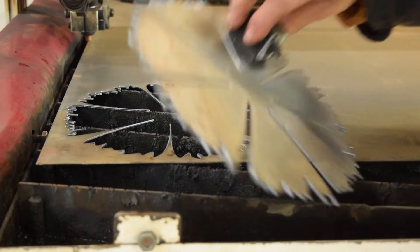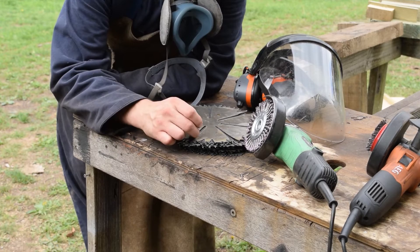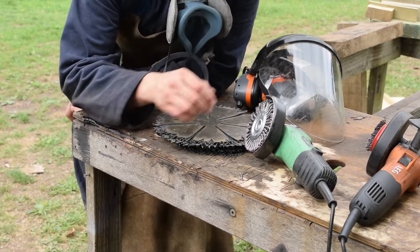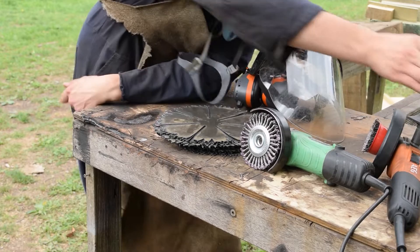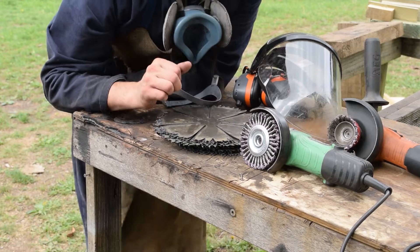Right, so we've got the 15 blanks now. I do like to run a pinch too hot — that gives you just a bit of slow-speed dross. It's not bad. Hit it with the wire wheel and it comes straight off. I like to do two processes: hit it with the wire wheel — the bigger diameter really does knock those edges off fantastically — and then come in with the smaller one to do all the surfaces.